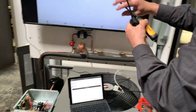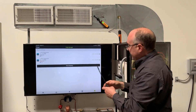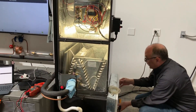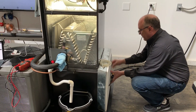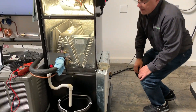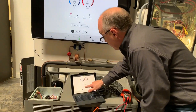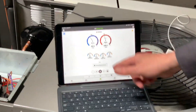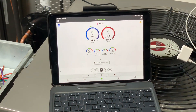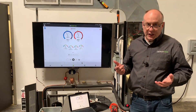So I'm going to go up here — supply air in the ductwork — just tap that in. That's good to go. Now come over here and close our filter grill up, and we'll put this probe on the return air. So now I've got a return air reading. If I come back over to MeasureQuick and go to my outdoor air readings, you can see I've got my return air coming in, supply air is coming in, and everything's measuring just the way it should. Now we've got a full set of measurements.